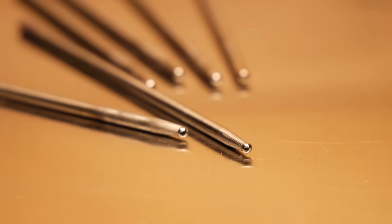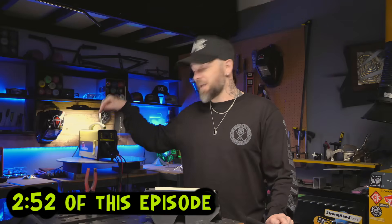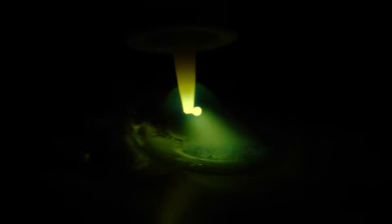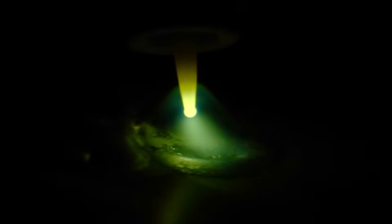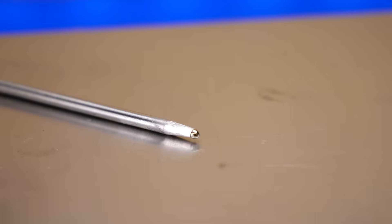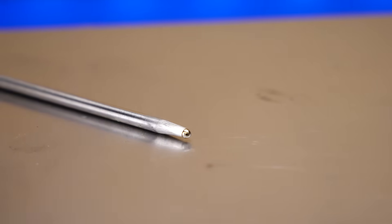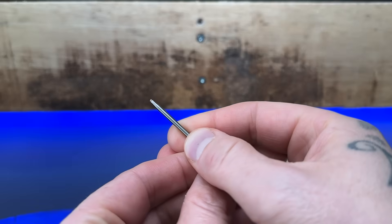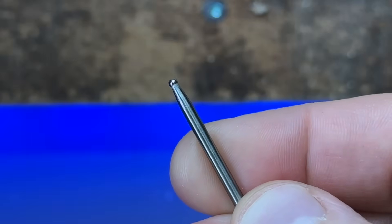I prepare my tungstens with a small ball on the end, as we discussed with balance earlier. If the balance setting is even slightly off from what you need, the tungsten tip becomes misshapen or deformed. Running a small ball on the end keeps things much more stable with no deformation. We're talking a tiny, tiny ball preparation. When you flash up — even on thin material — you get away with a little more positive-side cleaning action, which results in shinier welds. You also get that laser-sharp arc focus we want.